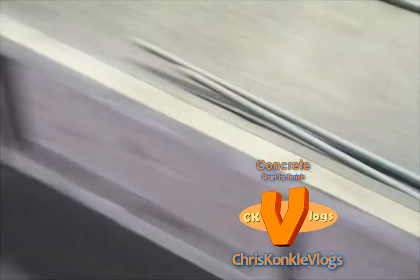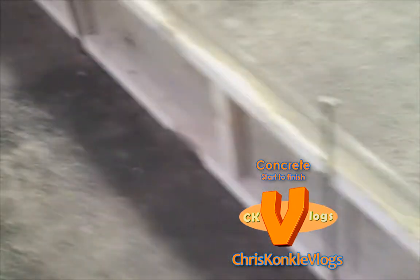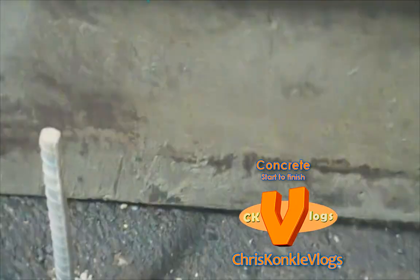On the first one, I only need to do it on the top. But you can just put a nail in the last rebar so that it is nicer for fastening your forms together. You can see here: 3 10M rebars per 8-foot form, going in a foot on either end. You can obviously move it here or there. And then we have our 15M rebar, which is a little bit bigger — we have the 10M here for support and then we have our 15M. We are going to put 2 rows of 15M, coming up 2 inches and then 2 inches space.